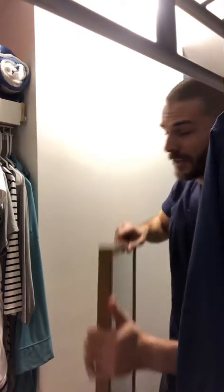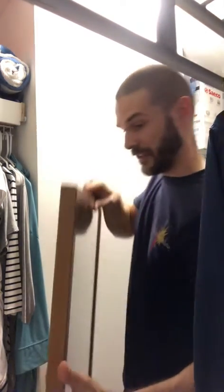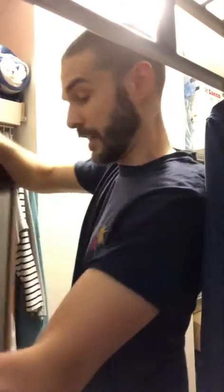This is the way I like to hang artwork — it's a tight space and a big frame — it's just two hooks. The reason why I like to do it on two hooks is because when I hang it, it's going to be level and it's going to stay level. You don't have to worry about bumping it, or a breeze, or the door slamming making it tilt. You just put it on two hooks and it's going to stay that way until you take it down.